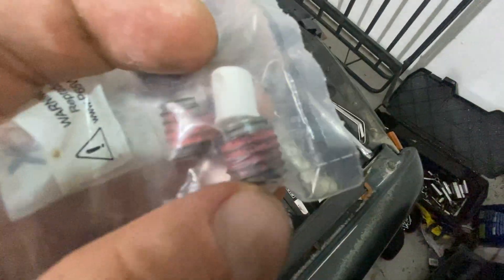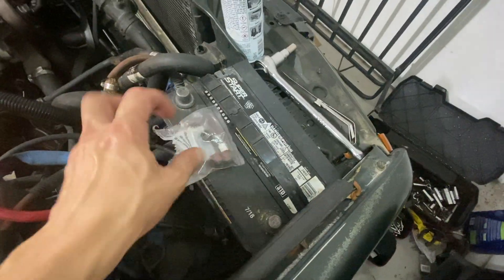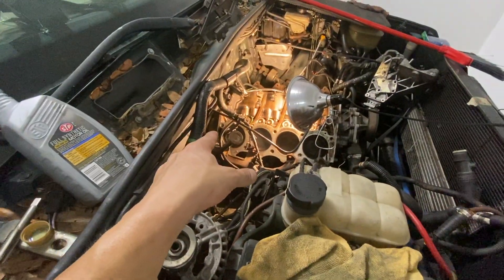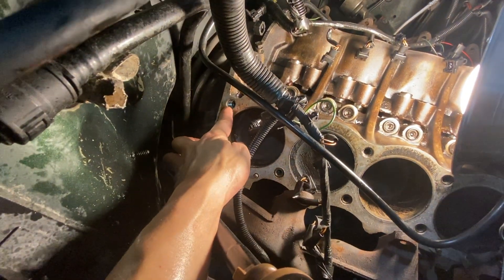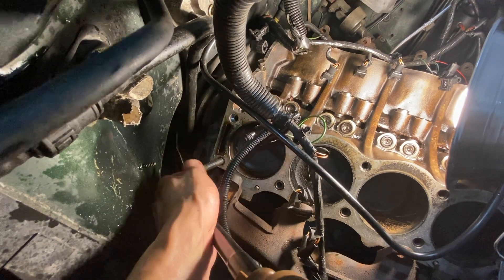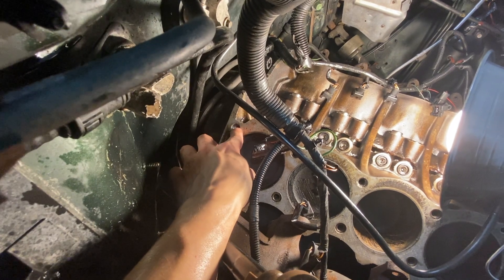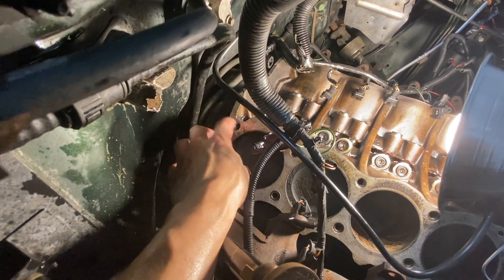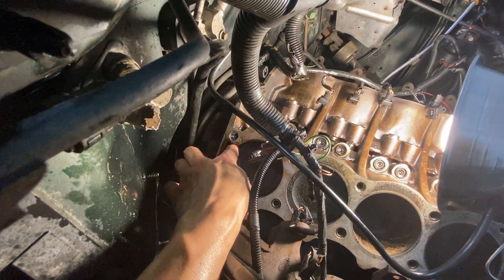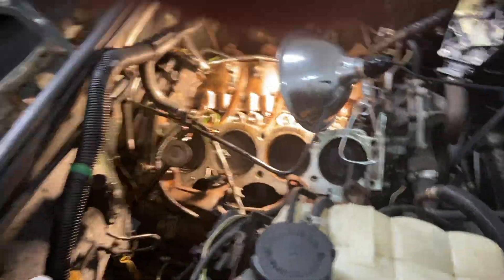The inserts are right here. You screw them in and they work as a sleeve, so when you put your bolts in, they go into this and it works perfectly. Make sure it's always straight — you don't want to drill the hole sideways or it won't line up when you put the top head on. I put the bottom bolts in loosely just to verify my tap wasn't going sideways.